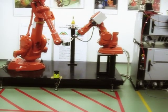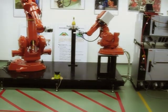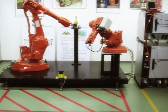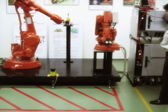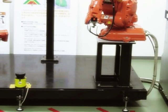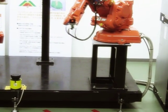The area in front of the two robots is supervised by a laser scanner. When an object — for instance an operator — enters the yellow zone, the scanner signals to the robot controller to slow down. As the operator moves out, operation resumes at programmed speed.